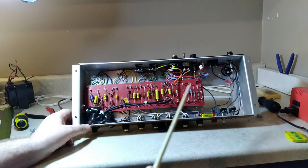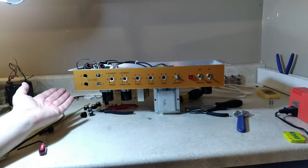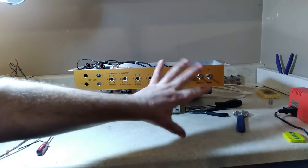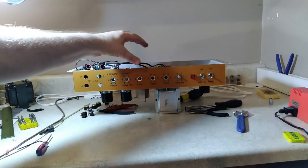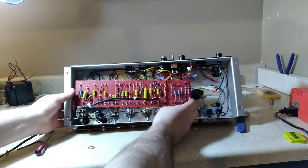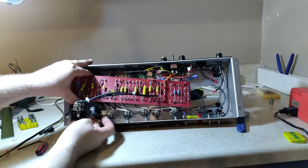I've had to do a little disassembly to get the capacitors out. The first one isn't too bad — it's right in the corner with a little wiring behind it. The others actually required cutting a hole in the chassis and they go right underneath the board, so I had to remove the turret board. The wires here were a little tight, so I'm lifting up the front of the board to pull these components out of the way and do the soldering with them accessible.